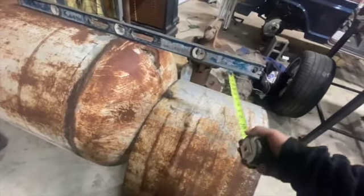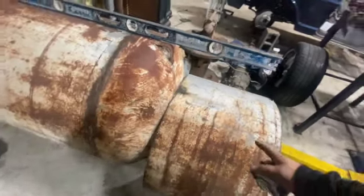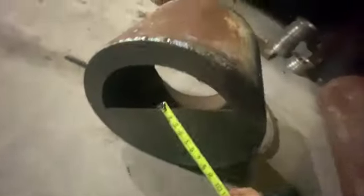So this is 8, that's 8. And we do 3 inches of insulation. This is the actual firebox, by the way. 3 inches gets us 11. We're trying to get to the middle of this with the grate. So from 11, we've got to get to 15, we need 4 more inches. So bam, 4 more inches.